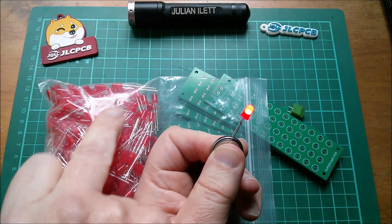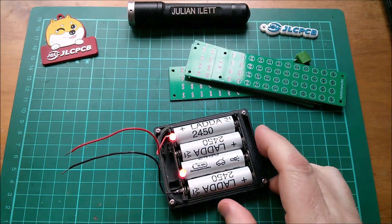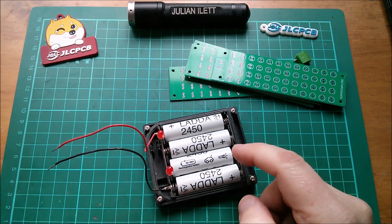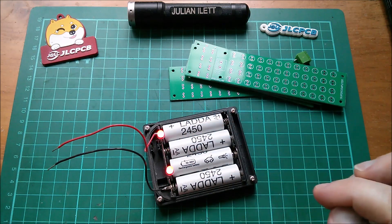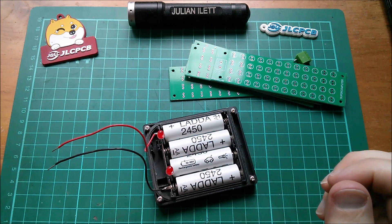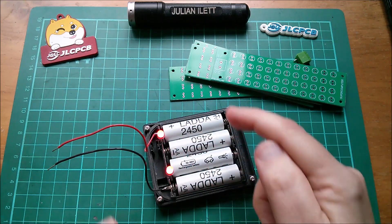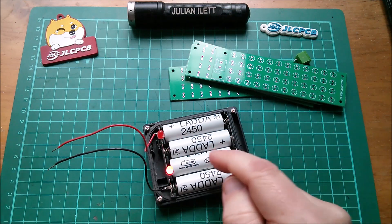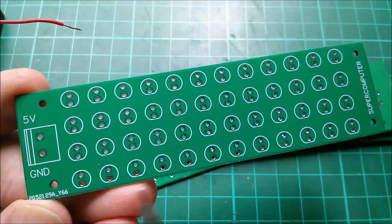I say approximately, because when you put a whole load of these together they all flash at different rates. I've had this one on my desk for a while — I've just shoved an LED across a pair of nickel-metal hydride cells, so each LED is running on 2.4 volts. Over time they gradually drift apart because their frequencies are slightly different, to the point that at some point they'll be flashing completely in anti-phase, and then over time they'll come back into phase and look like they're flashing in lockstep.